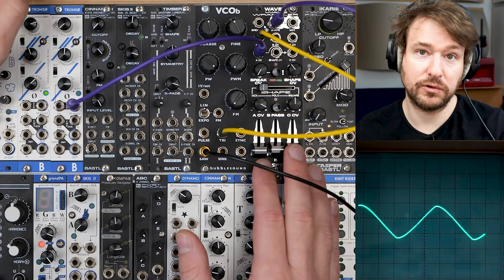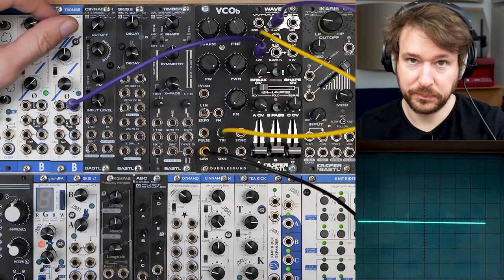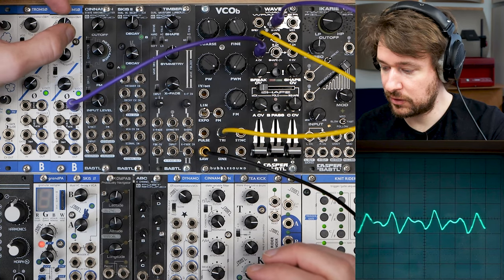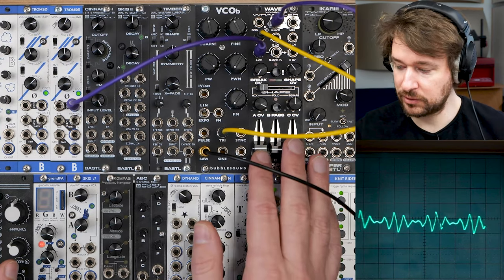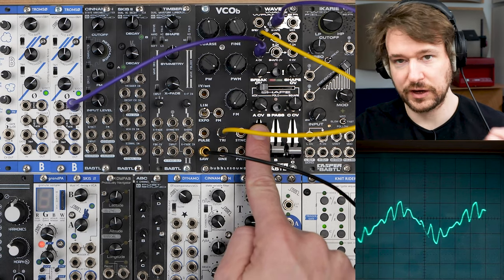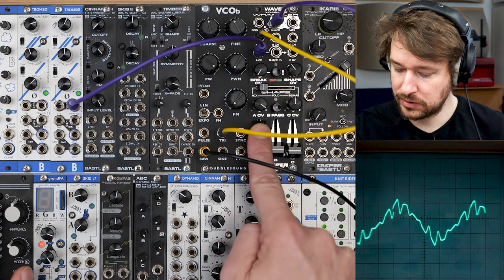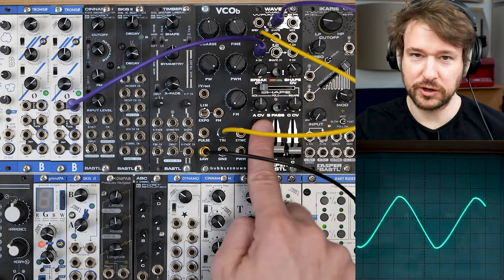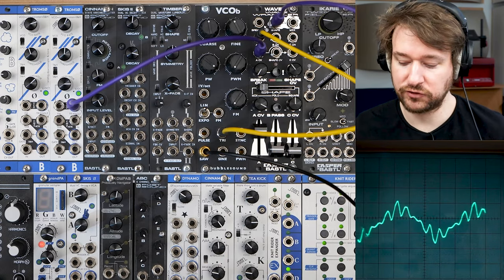This is really good for audio rate modulation, which is essentially what ring modulation is. With the fader down and the CV up, that's the ring modulator. I'll pull up the modulation frequency to something nice. As you can see on the oscilloscope, that's quite the typical ring modulation sound. You can also pull up the original signal, which really strengthens the fundamental frequency. I'm listening now to the shaping output, which has a bit of a bass boost — that's because with a lot of wave shaping you tend to lose the bass, so it brings it back in.